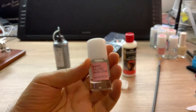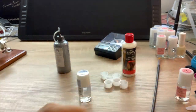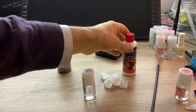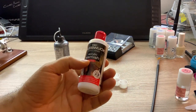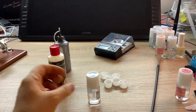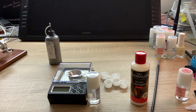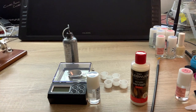Alternatively, you could use a filling base coat or other things that girls use for their nails — so you should go to the beauty store and get any of these. For the sake of comparison, I'm also going to make some conductive paint using acrylic varnish, and then we'll compare the conductivity of paint made by nail hardener versus acrylic varnish. I'll use a scale to create different conductive paints with different percentages of graphite powder, and then we'll see what type of conductivity we achieve.